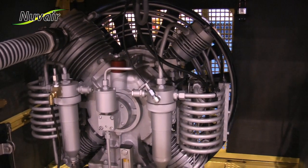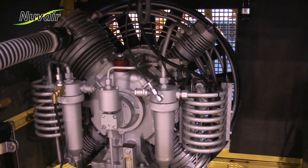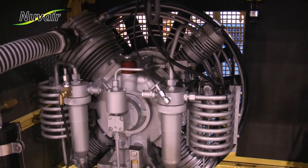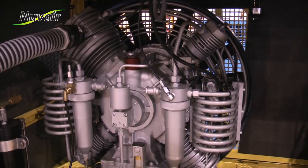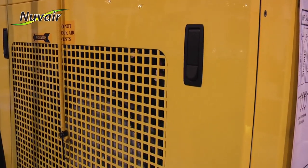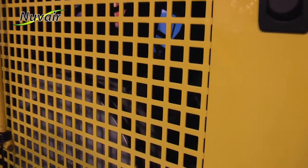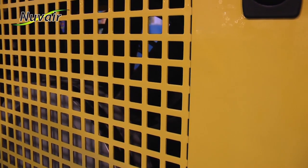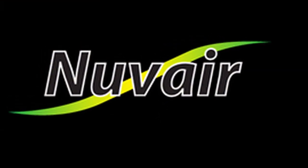Be sure to check rotation on your high pressure compressor when initially installing the unit. If you ever make any wiring changes to your electrical panel, check the rotation again. The compressor should go clockwise when you're on the front side — it's probably easier to look from the back side to see if the rotation is correct. There's a rotation sticker on the back side of the Voyager 2, 3, and 4 to indicate which way the fan should go. You can bump-start the machine by starting it and then turning it off right away to see which way the fans go and confirm correct rotation. Thank you very much.